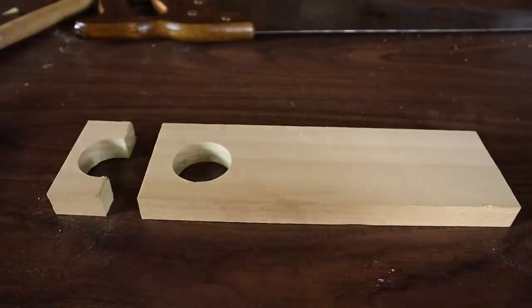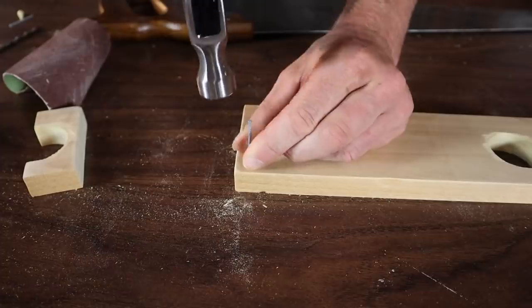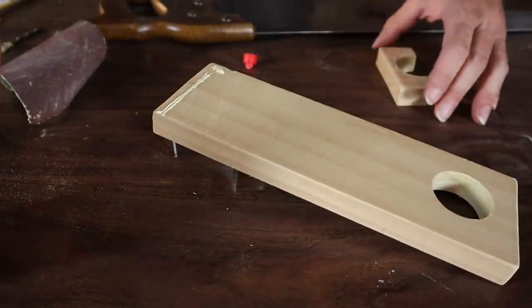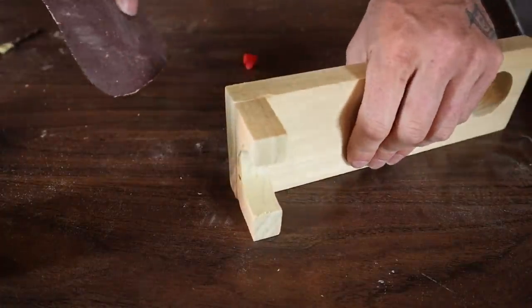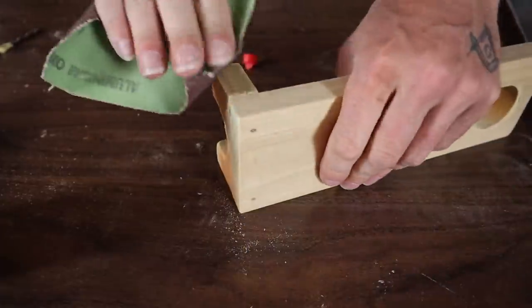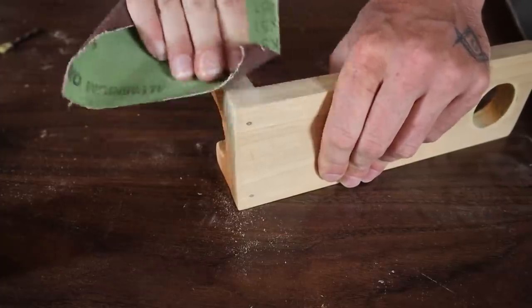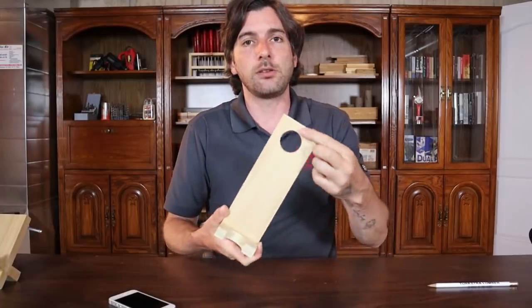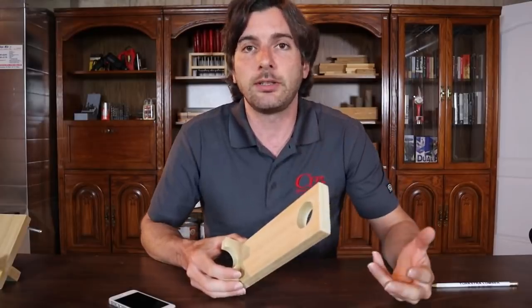If everything has gone according to plan, you should have a couple of pieces ready for assembly. Get your nails preset so it's easier to nail together, apply a little glue, put the piece on, flip it over, and nail it up. Give it one last final sand — clean up the edges, and if the attachment edge is a little uneven just give it a good sand to smooth it up. This phone holder is 10 inches long, the hole is an inch and a half down from center, and the bottom piece is an inch and a half. All dimensions will be in the description below.